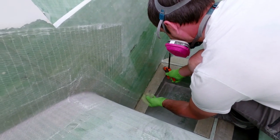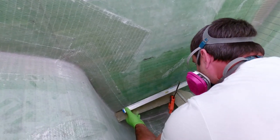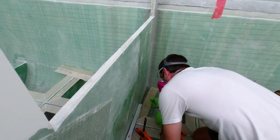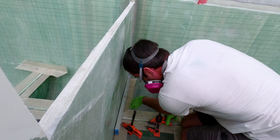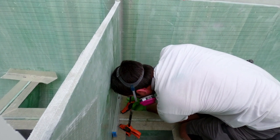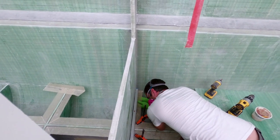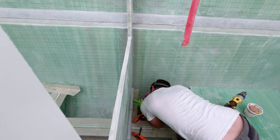Although we'd already done a few sections just to test out how things would go, today we planned on working on the owner's hull, both fore and aft of bulkhead 6. In the areas that adhered directly to the bulkhead, a level was used to keep the proper height going abeam as we matched up the edge to its neighbor facing fore and aft. Then, since our MDF mold does not cover these areas, Matt made sure to keep it in place by drilling a small hole and adding a stainless screw. This will get removed later once the resin has cured.